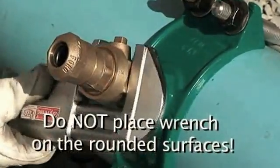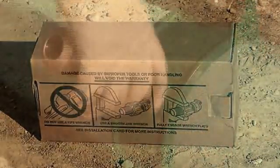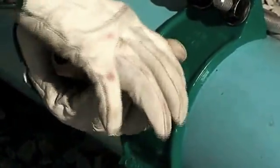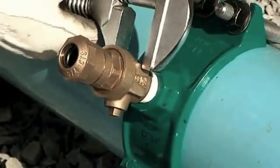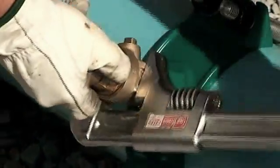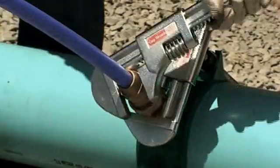Use a smooth-jawed adjustable wrench and fully engage the wrench flats on the valve. Loose-fitting wrenches and pipe wrenches will distort the valve and cause leaks. Damage caused by improper tools will void the warranty. Never use a tapping machine to complete tightening of the ball corp in the water main. Place the wrench on the location provided on the body. On inch-and-a-half and two-inch Corp Stops, it is necessary to place the wrench on the outlet end piece's wrench flats.